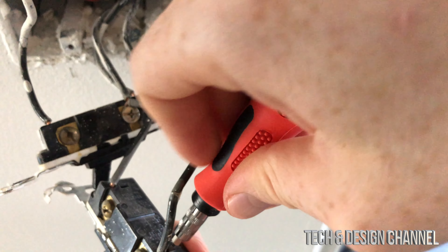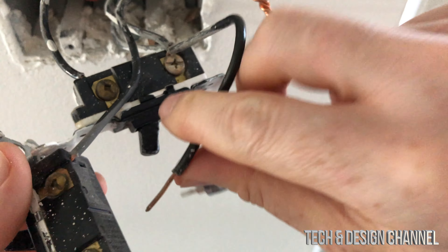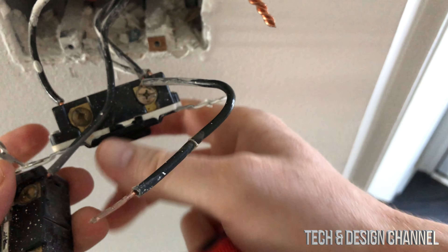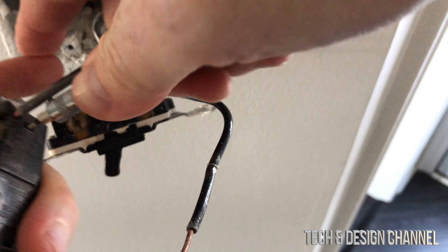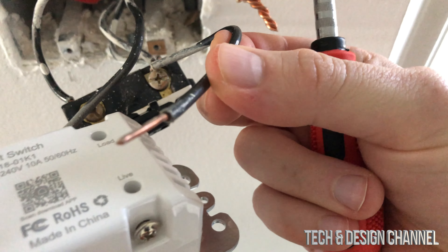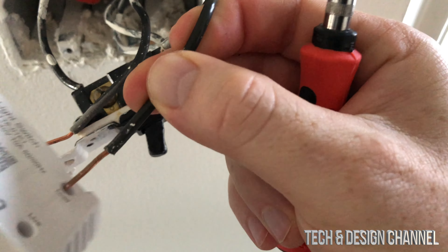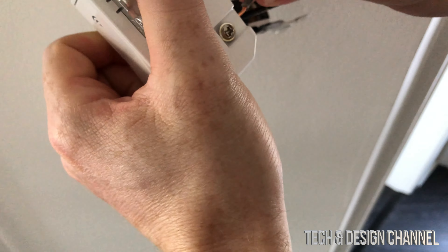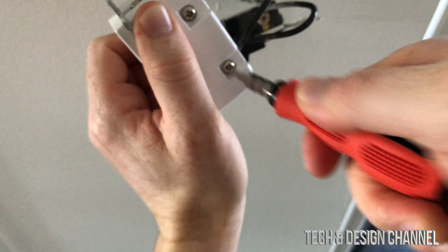Sometimes it's pretty hard, sometimes it's easy. There we go — it wasn't the easiest thing in the world but it came out. If you can have some help it's going to help a lot, but you can do it one-handed — one hand presses and with your finger you pull it out. At this point we're going to connect our live; actually our load goes right here. So load goes there — we lock that side and press this one here for live. You'll feel it or hear something when it goes all the way in, then tighten it up.